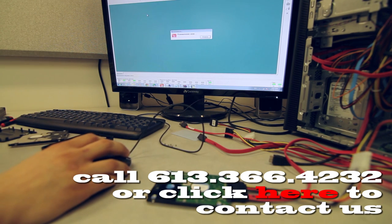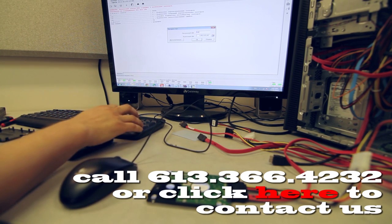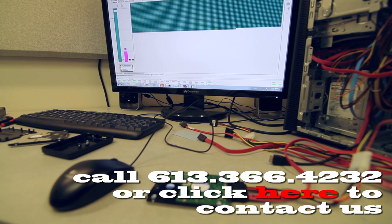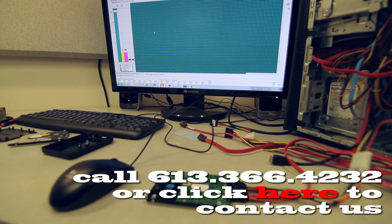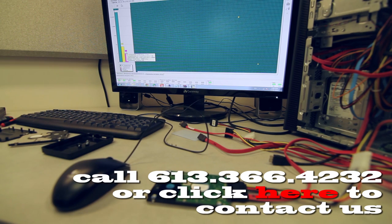Go into Universal Utility and just let the drive read for a little bit, starting somewhere in the middle of the drive. Okay, right now, it's performing an express test, so it just quickly glances through the data. Seems like no interference with any heads, because this is reading really, really fast, and we've gone through about 5 million sectors so far, and no heads responded with any delays. The occasional yellow spot is completely fine. Usually that's where the heads switch, so that takes a little bit of time, so it reports that there's a slowing down going on, but technically it works like it should.